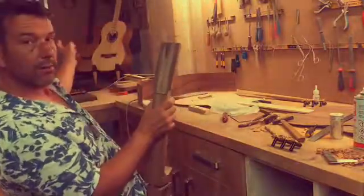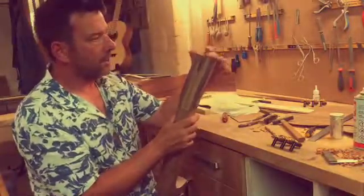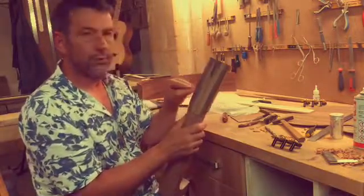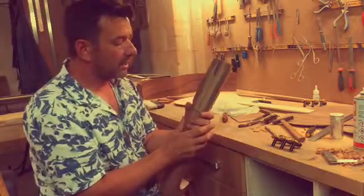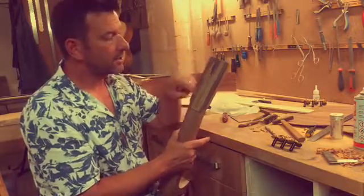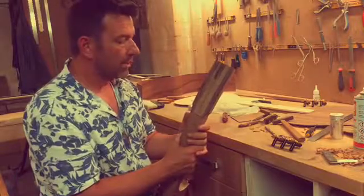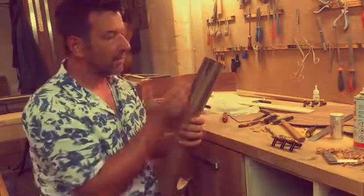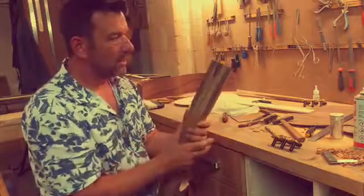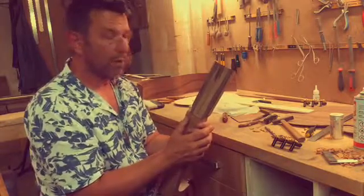The guitar at the back there, the darker of the 2 flamencos over on the other side, was my first flamenco guitar. And I made the error of cutting the 2 slots in the front and then trying to drill the holes through afterwards. Although in the grand scheme of things it still worked, as I drilled through into the open space that I'd created in the front, I got tear out from the drill, which put me in an absolute world of pain tidying that up. I got very close to running out of spare meat along the struts of the edge of the guitar, the headstock. But we got there in the end. Take it from me, just do it this way round and you'll save yourself all manner of issues.